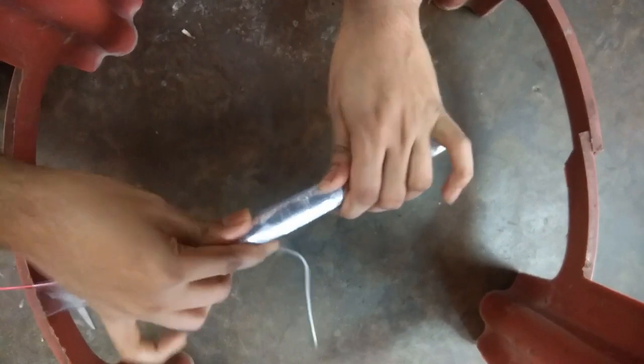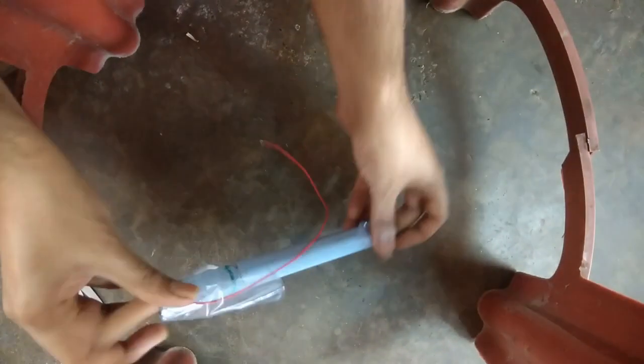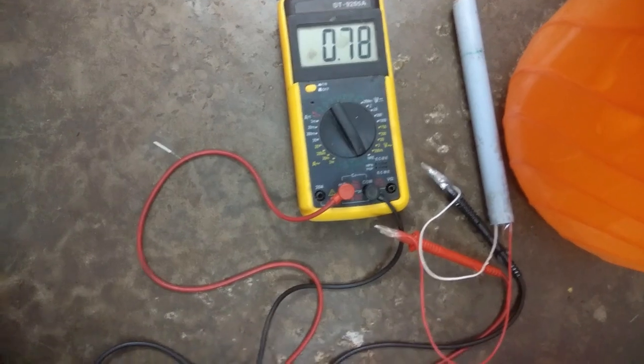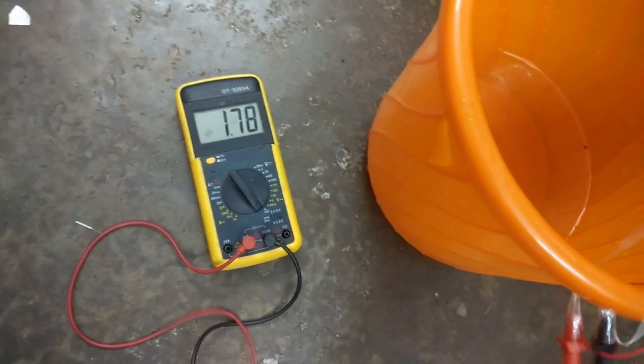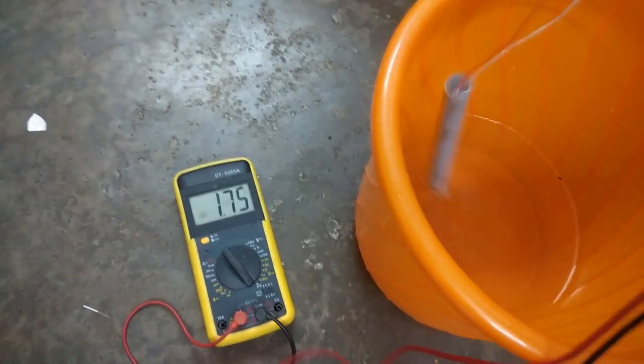Finally it will look like this. If it is done wrong, you will see white patches in the plate and you will have higher capacitance — more than 5 nF, which is very bad. Normally in air, depending on the plate area, the capacitance I got is 200 picofarad to 800 picofarad, or 0.2 nF to 0.8 nF.